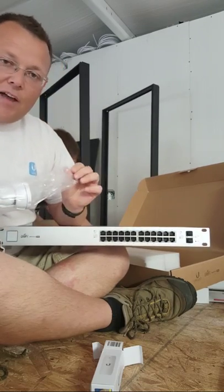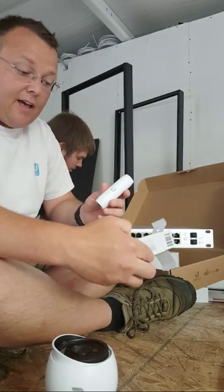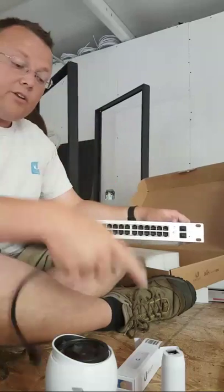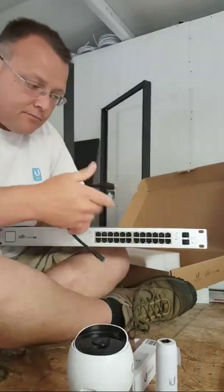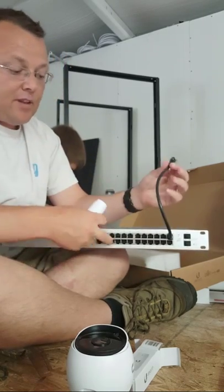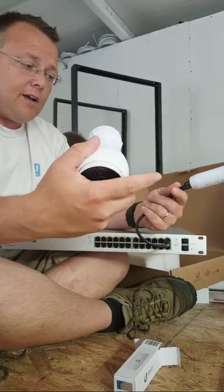Don't get too hot and bothered about this — this is not what the actual wiring is going to look like, I'm doing this as a demonstration. What we have here is the G3 camera and our 802.3af adapter. If we plug this in — between software and hardware changes we can only do standard PoE with this — we're going to use these converters. If this batch of cameras is passive only, which it looks like it is, we'll go into a port and make sure PoE-plus is turned on. On this side it says PoE in, so we're going to go from the switch to the AF adapter. We've got this hanging off the switch just like this.